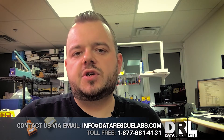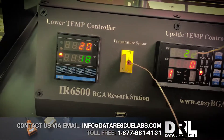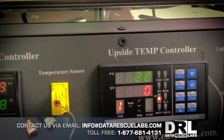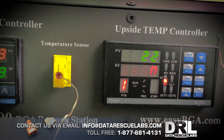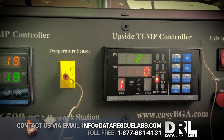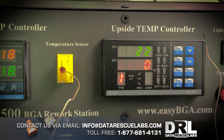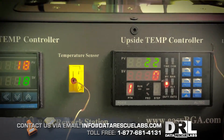What's really good about the station is the thermocouple — it can go directly by the chip so we get proper temperature readings. There's a bottom plate we can set to a certain temperature, and then there's the top portion where we can control the top heating element. You can set up different steps, each step how long it takes and what temperature it should be at, so you can gradually increase the temp and not shock or damage the chip. So far, on any chip we've used this machine on, we've had a hundred percent success rate, which means the risk of damaging a chip goes down drastically.